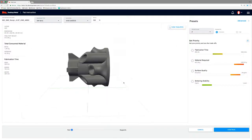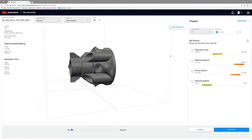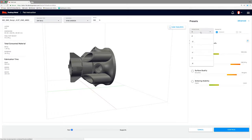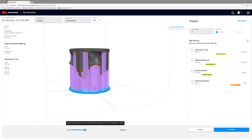Fabricate Software constructs build plans from STL or native CAD files. Based on the user-defined parameters, material and part geometry, Fabricate automatically adjusts the design for part shrinkage, constructs advanced supports, and determines optimal orientation.